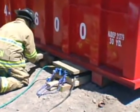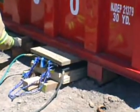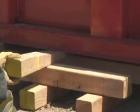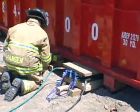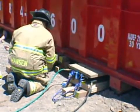As we can see, as soon as the bags begin to inflate, there's a reaction. The dumpster is being lifted because our lifting force is being distributed along the plywood pad. As we lift, the firefighters are stabilizing the load with the wedges. Hold on black. Up on blue, slow. Once again, we use stacked bags. We alternate the lifting operation between the top and the bottom bag. Up on blue, slow. Stop on blue.